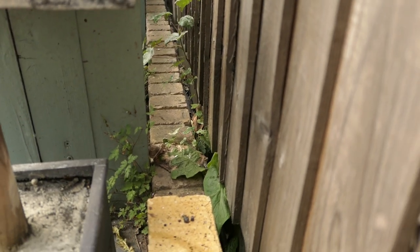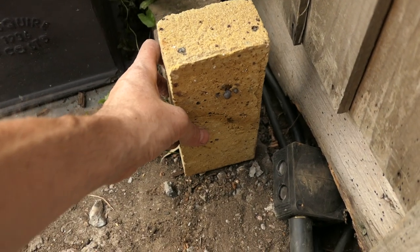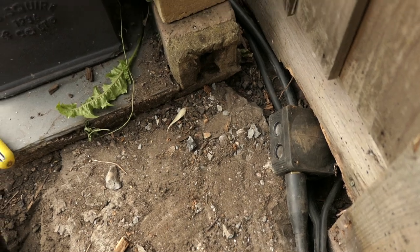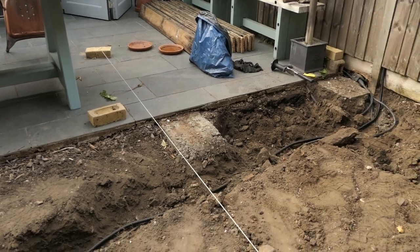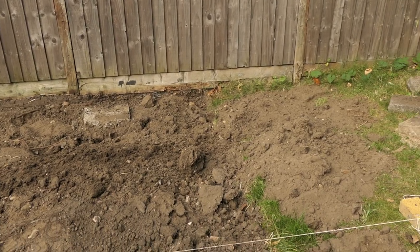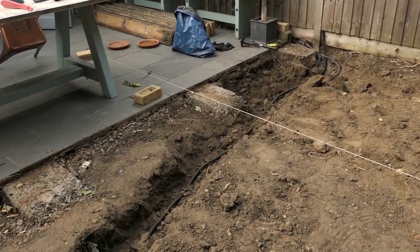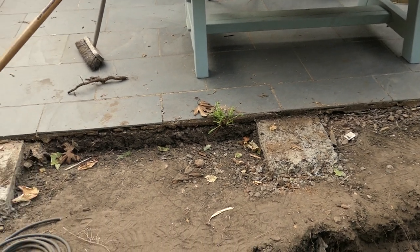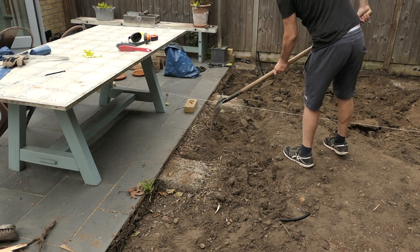I'm going to continue this wall here but that's going to be in the next video. These are the bricks that I'm going to use. I'll half this brick and set them on that concrete base. I've put this line in place to work out the level and how far I need to dig down. I'm going to use all the excess earth to extend the grass area. This is the patio area that I'm going to be extending and I'm going to take out these half slates and replace them with full size slates. The depth is about right on this section here — this is where the decking is going to go. This is already 15 centimetres deep.